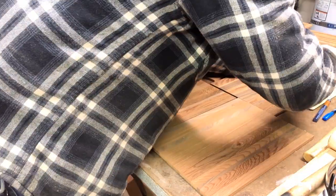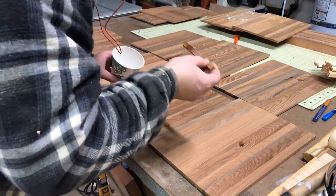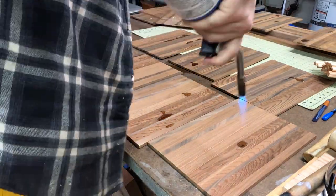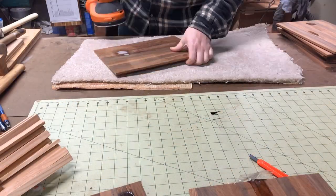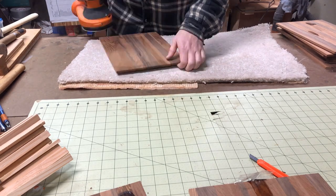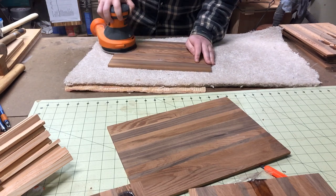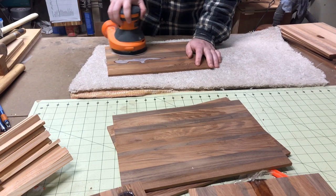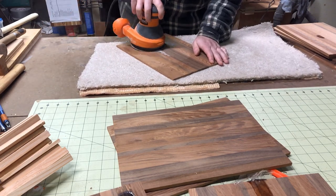These were reclaimed pieces and naturally they just had some faults in them, so I went through with epoxy and filled all the little bug holes so there were no imperfections in the writing surface to catch a pen and rip through the paper. And then on to sanding — just using 220 grit. It eats through the resin pretty fast and I don't have to worry about it chewing up the clipboard surface.